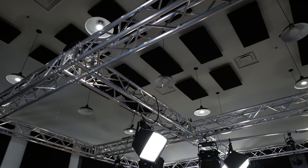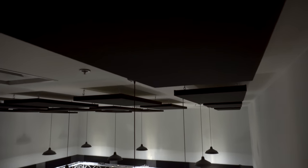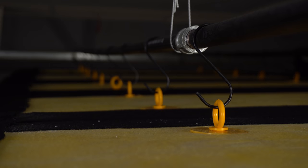For the ceiling panels, I was originally going to do something like I did over at the Drumeo Studios — a laser level grid on the ceiling with drywall plugs and eye hooks to suspend the panels. But I wanted to simplify it: I had the garage door track, so I just put the steel pipe across and was able to suspend the panels off of that. Now that we have really nice acoustic treatment for the entire mix position and the rest of the room, we are fully ready to record and mix some awesome sounding instruments to a much more accurate degree in this home studio space.